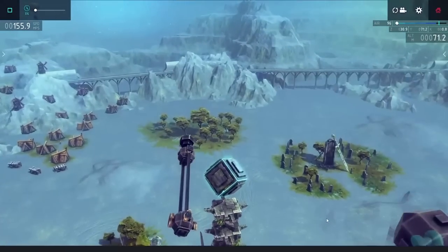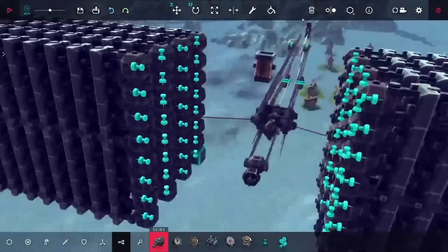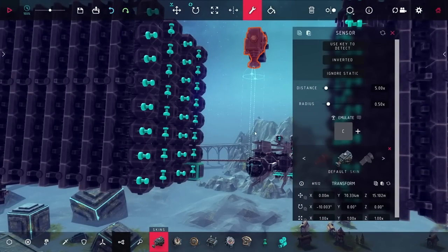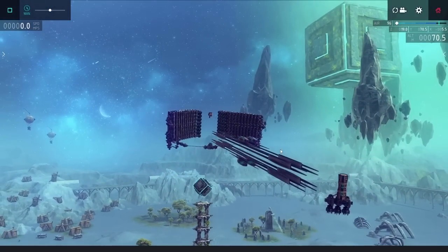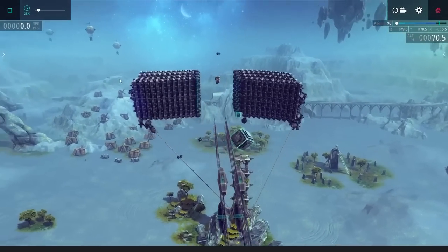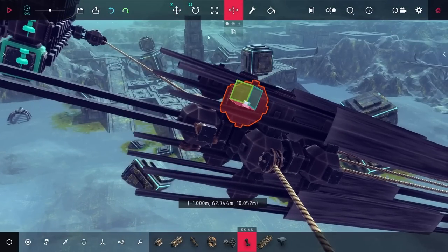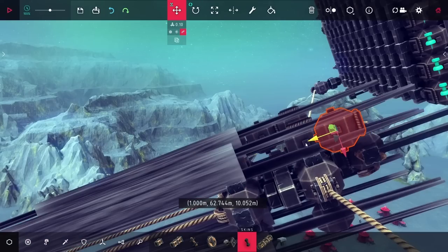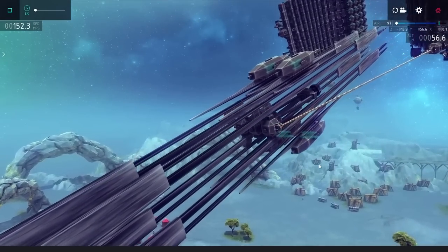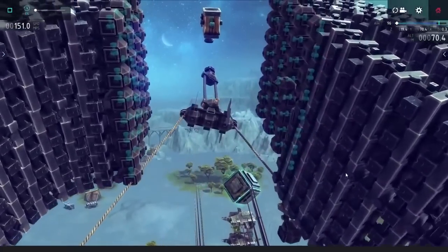Firing this off for the first time, it was totally working. Putting this back to 100% speed though, you can definitely see a small side effect of adding those propellers on. At the very least it was working, and I ended up adding on a sensor to the front of the bolt to automatically release it once it gets to the front. Trying this out at 100% speed, it did go up into the air a bit but it did also seem to work, and it released exactly as I wanted. In more tests it still seemed to be working, but I really didn't like the way it was dancing around. One very easy solution I found was adding on two extra ballasts to the back of the bolt — by doing this it prevents it from rotating too far down, and this totally solves my problem. This does add a little bit more friction so I was firing a little slower than before, but it was working really well, and now I was able to shoot a bolt forward and not have it bounce around in the air.